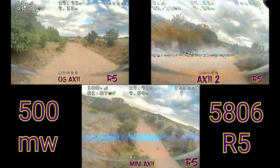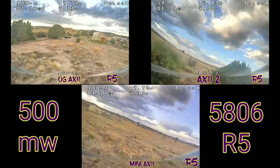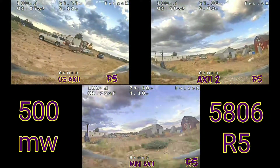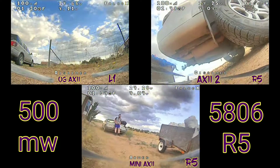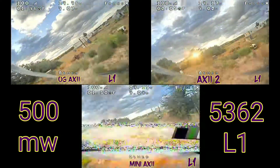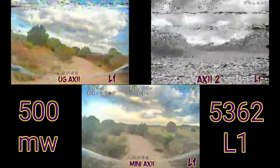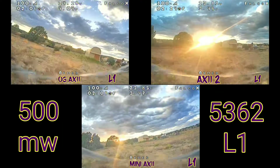I did this for every single test, and before doing the first test I plugged in the quad and let it sit at the designated wattage for two minutes before actually flying. If you'd like to watch Brake Still's video, his link is in the description below. We just finished up the Race 5 at 500 milliwatt test and are about to test Low Band 1 on 500 milliwatts. The reason we're testing Low Band 1 is because these new antennas say they go down to 5.3, and Low Band 1 is the absolute lowest band you can fly. Legally it is way below the lowest legal band; I am only using it for the purpose of this test.